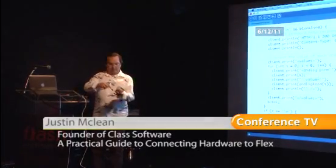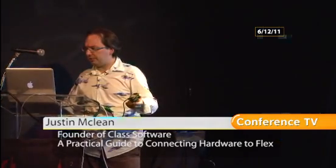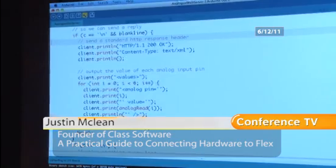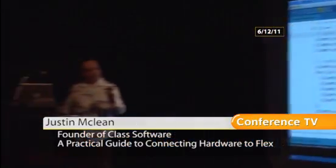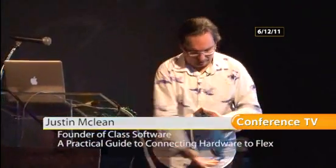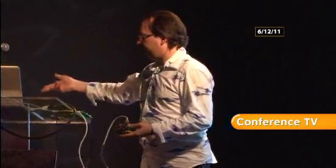So let's plug this Arduino in and upload that code. I have to choose the new serial port, and once I've done that, hit upload. And that's uploading. The little lights are flashing on the board there. Yep, okay, that's uploaded. So I'm actually going to unplug it from the USB there, plug in some power, and then plug in an Ethernet cable. So power by Ethernet is not by default? It can be, but Mac laptops don't support power over Ethernet. So you actually need a little device called a power injector. And you can do that by hand. You can just cut the cable and put power down 2 wires or do something. You want to hold that for me?